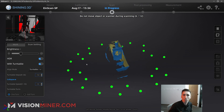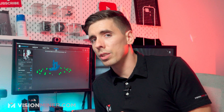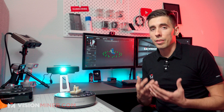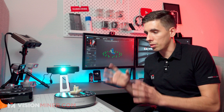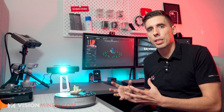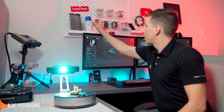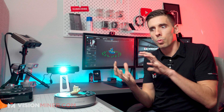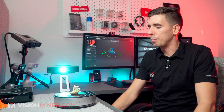You can see those green dots are the markers and it's just going to keep going around and capturing. This unit is really for small parts that fit on the turntable where you need to automate the process. It does have some limitations — if this is a black object or a really reflective object, you'd need to spray it with disappearing spray. AESUB works great — it disappears in about four hours or less. If you don't want to spray or coat anything, then the HX is probably the best option for you.